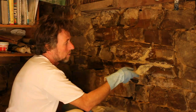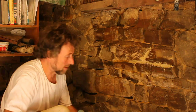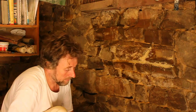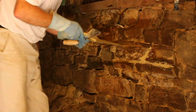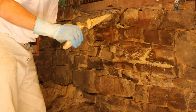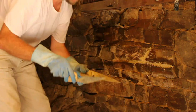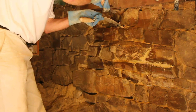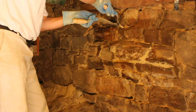I'll clean any overspill off with a wire brush afterwards, and there'll be no remnants of lime left on the stone when I've done. So I'm going to pack this hole here — it's quite deep — and get plenty of mortar in. It can be painstakingly slow, but it's better than having to rebuild the whole front of the building.